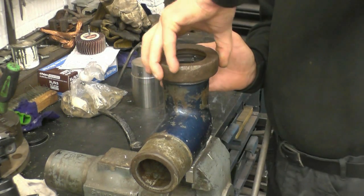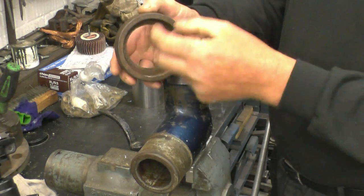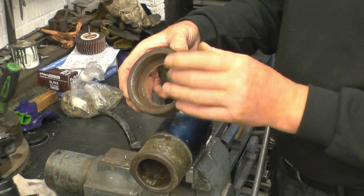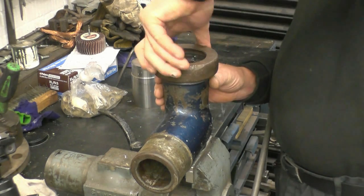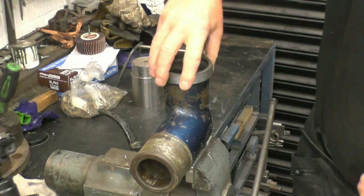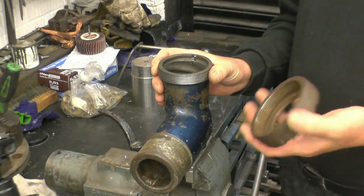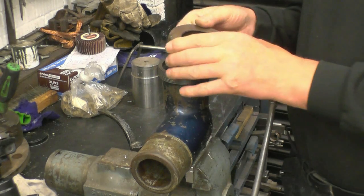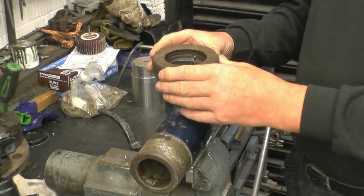So what I need to do — I can't do much with this because it's cast iron, but this will just be steel — I'm going to make a new lock nut for the end of it and try and make the threads a better fit on there. I think both sides are badly worn. So I'm going to measure this thread, find out what pitch it is. It's bound to be English, bound to be Imperial. I've got a bit of steel and we'll make a custom made nut and try and make it a better fit. I'm sure I couldn't make it any worse.